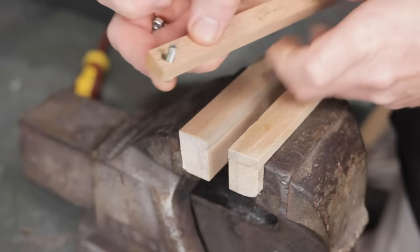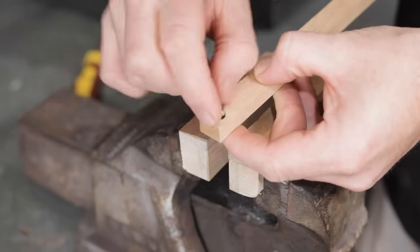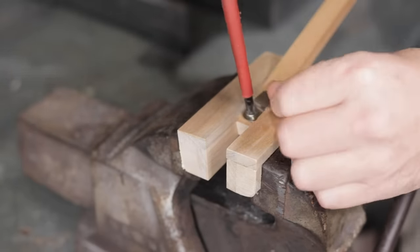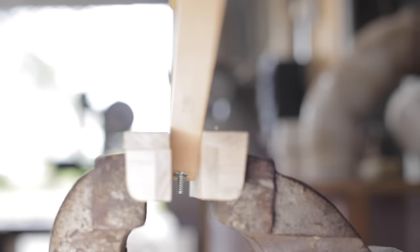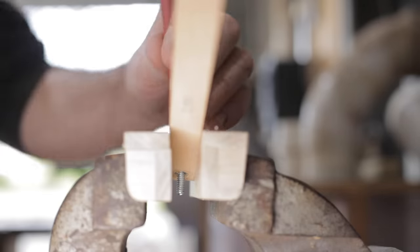Here I'm pressing nuts into the holes I just drilled. I could have used threaded inserts, but as I don't have enough without going out to get some, I thought I'd manage with these 3/16 machine screws. I'm supporting the end of the arm by clamping it in the vise, otherwise the end of the arm would almost definitely crack.